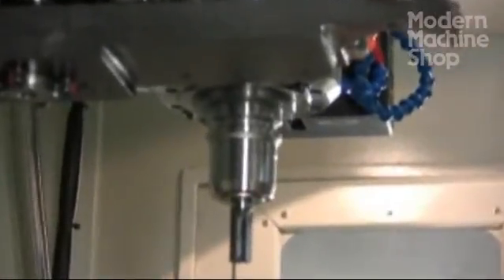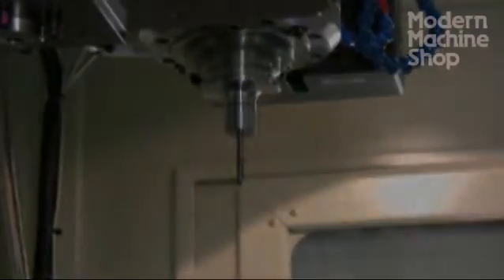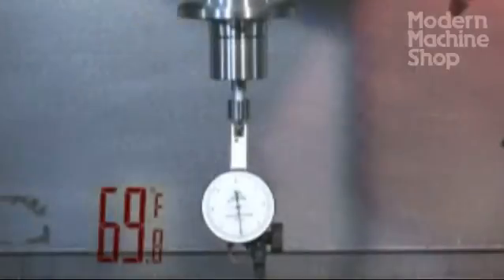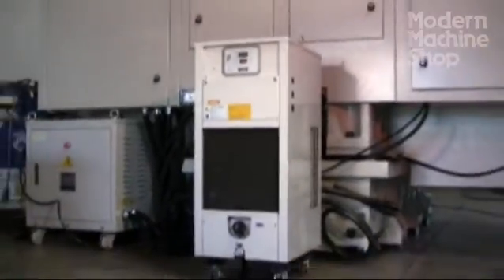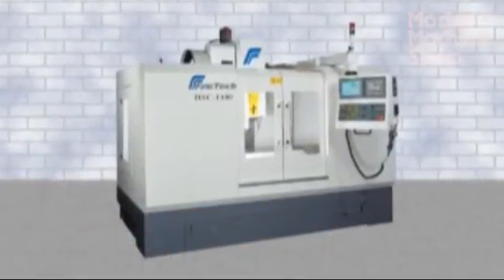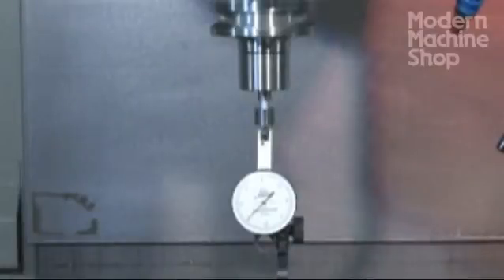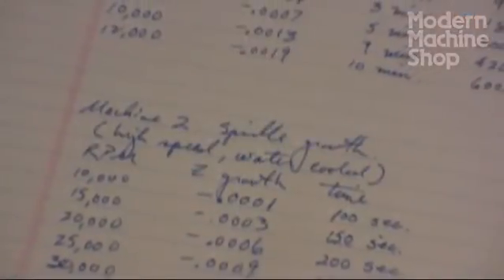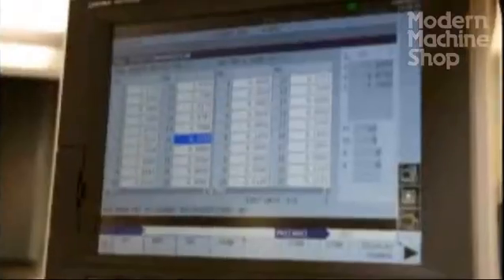The spindle of your machine may be one of the most obvious sources of inaccuracy as it grows and shrinks. Changing spindle speeds will most always change the tool height. Machinists often report Z-axis variations of two thousandths of an inch or more at normal operating speeds. Refrigerated, closed-circuit chillers are often used to cool the spindles and minimize thermal changes. Still, some growth is normal in virtually all spindles. One of the best ways to deal with spindle growth is by planned tool offsets and warm-ups. First, get familiar with your spindle's actual growth at various speeds by testing and charting it. Then, when you set your tool offsets, add in compensating values to help correct for the growth.